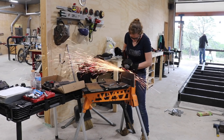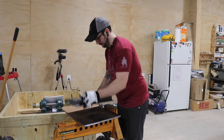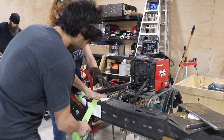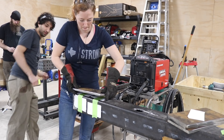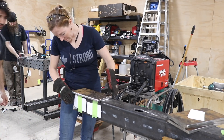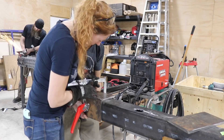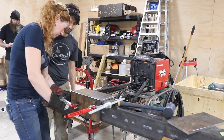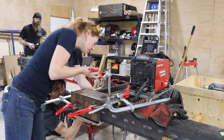At this point we were waiting for a lot of parts to cool down before standing the carriage up, so we kept ourselves busy with peripheral tasks. Johnny started making a plate for the motor mount. Then I worked with Matt to make a sleeve that goes on the saw head beam — it's not fixed in place, it needs just enough wiggle room to slide back and forth slightly, because later it will be used to tension the blade.